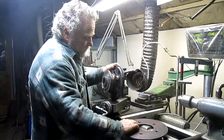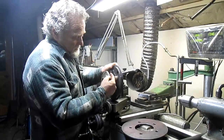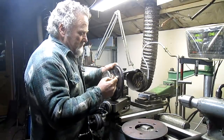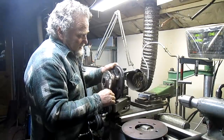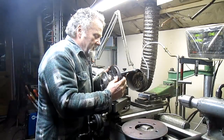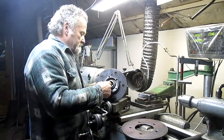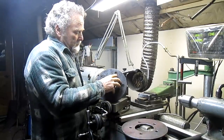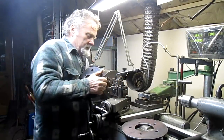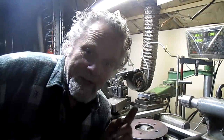discs. So we're going to make some fairly long studs, well, not as long as this, but as long as this, and put the plates on and allow some room in between the plates, and then set up so that the studs will grip the plates. And then at the same time, what he wants to do is to make an axle that's going to go through here and bolt to the front side and allow this part to ride free. So that's pretty simple. And I think what we're going to do is we're going to start with the axle. Before he calls me again and says, "Stop!"